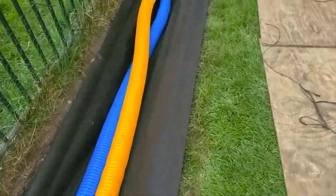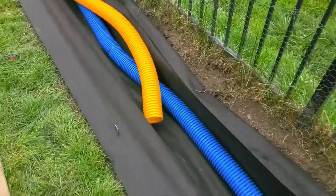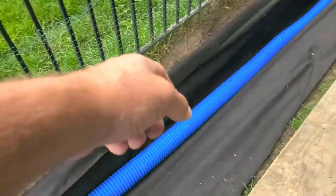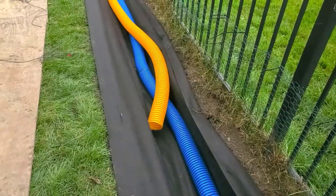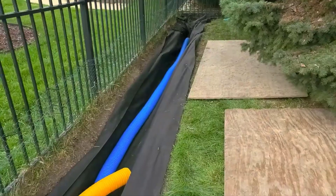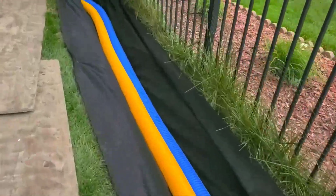As you can see, the roof runoff water is a separate system from our french drain system. We're going to put a pop-up right here, and once we get the burrito wrap done we'll have an open french drain back here that's just going to scream. When the water comes out of the pop-up it'll run through the stone into the french drain system. A lot of people have commented whether the roof runoff underground system will overwhelm the french drain — absolutely not. That pipe can take 240 gallons of water per minute, that's a lot.